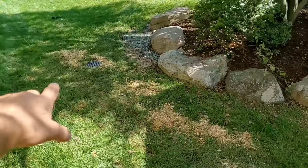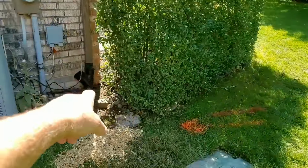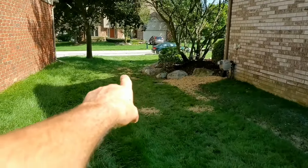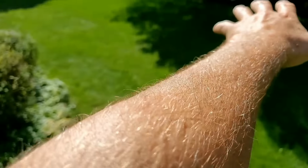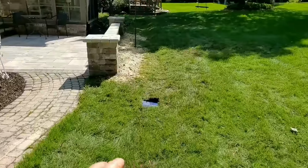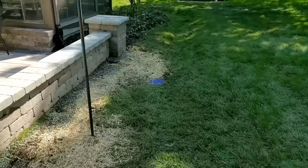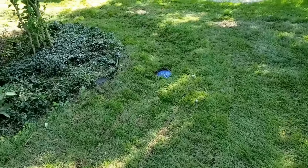We got our D-box, we got our 9x9 outlet basin. There are actually two downspouts with clean outs tied into that one D-box and that one 9x9. Now back here we have all the sheet water coming off the higher ground and we have this really nice swale the guys worked on. Did a beautiful job. Very time consuming. Integrating a swale where there's never been a swale, you're going to need to put some extra time in on that.